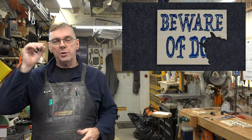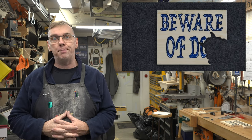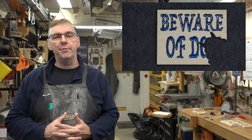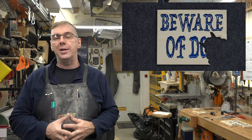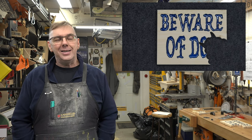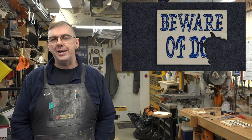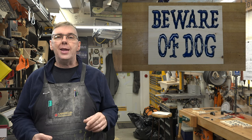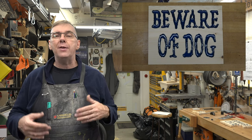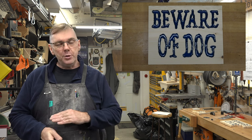If you don't have resin, don't worry about it. The original intent was to use paint, and that's the way I did my original signs. Unfortunately I got a little overzealous with the depth of the router bit, and the cavity was too deep to paint with any accuracy. If you're going to paint, go with a shallower route, then just paint away on the inside. If you spill some on the outside, the same way we used the chisel on the spilt resin, you can chip most of it off and then sand to get rid of the rest.